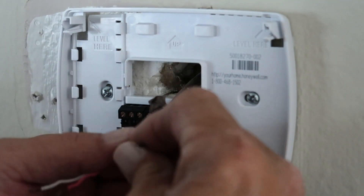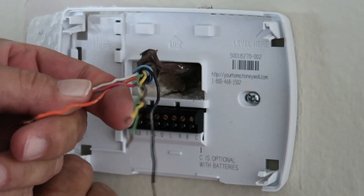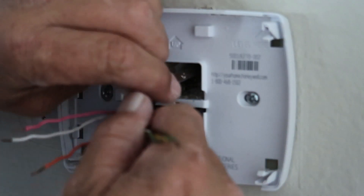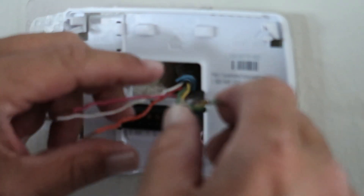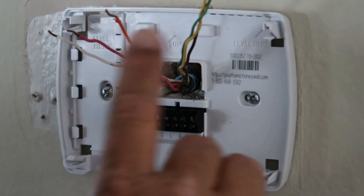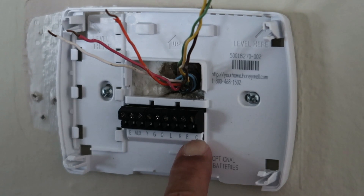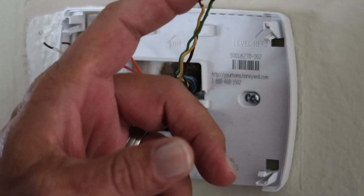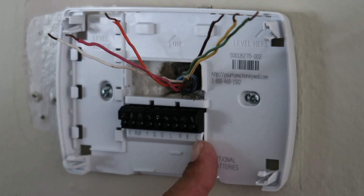Black is an extra wire. Normally on standard heat pump systems you'll have a few extra wires that are just wrapped around the back side. It's a good thing to have — if you get a short in one of your other wires, you've got a couple of extra wires you can convert over to maintain your low voltage system. Now, the terminal block has color codes on it, but pay attention: brown is your common, but you'd see blue or 'B' on the block — you wouldn't use that label. You're going to use the brown wire under the 'C' terminal. There's not always going to be correct color-for-color or color-to-initial matching, so just pay attention to where your common wire is and which terminal on the base plate is your common.